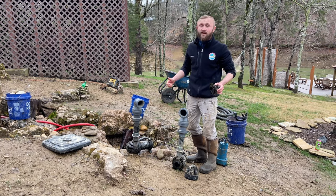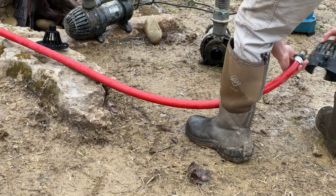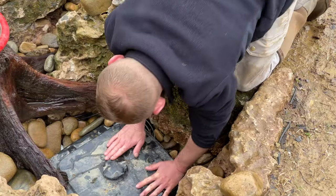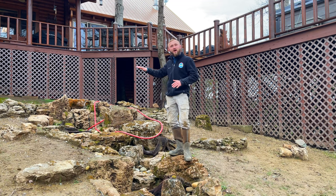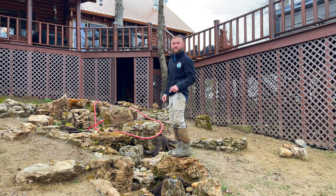We're ready to cover the vault back up and fill this thing — you have successfully completed your pondless waterfall clean out. One last thing: the reason we fill the entire thing while it is off is that if you fill the reservoir while the waterfall is actually running, you've got all this water in motion suspended in the stream. If you unplug the pump, however many gallons that is will run out of the feature down the hill because your reservoir is already full. So fill it completely first, then shut the hoses off and plug it in.